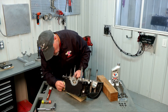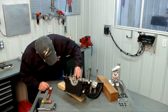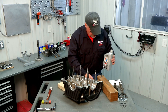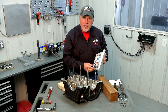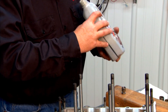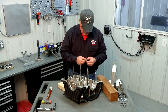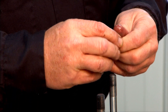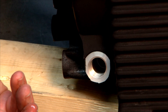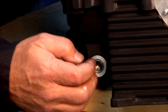This port right down here at the bottom is your forward oil control plunger location. We're going to take a quick look in there to make sure there's no debris or any foreign matter — it looks good. We're going to take just a little bit of motor oil on our finger. This is our standard motor oil — we use Valvoline VR1, though there are other approved oils in the manual for the AeroV engine. Get a little bit on my finger and get it all lubed on that oil plunger. The little tee part or mushroom part — the closed end is going to go towards the engine and it'll slide right down in there.